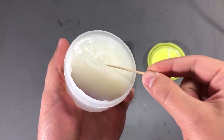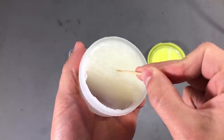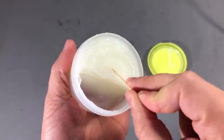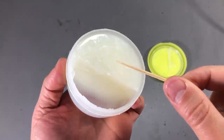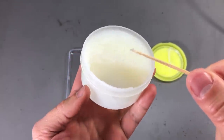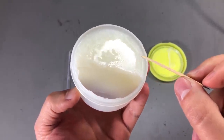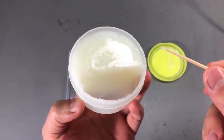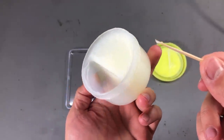The consistency is that of butter or a paste, so it would be impossible to put this inside a syringe and dispense it that way. This works better if you pick it up with a toothpick or some tweezers. This is not rosin-based, or so they advertised, and it's supposed to be a neutral pH with low corrosion to your PCB and components. You'll probably see me use this in a future video; until then there will be a link in the description so you can order one for yourself.